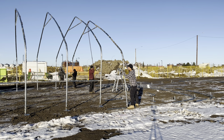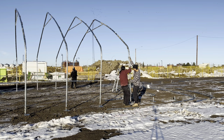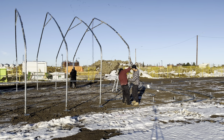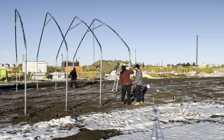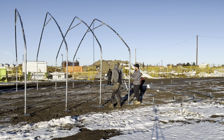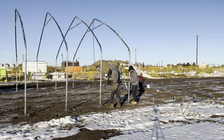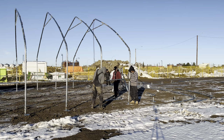After we put the truss in the base plate, we installed a horizontal, and then we proceeded to install the second horizontal after popping the truss in the second base plate, like you see us doing here. Later on, we would just pop both of them in place and do the horizontals at the same time once we got comfortable with everything.